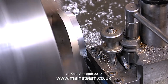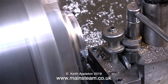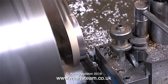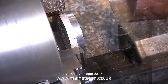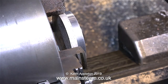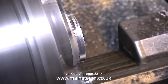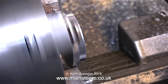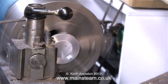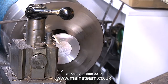This particular cutting tool does not cut very well on a left-hand cut, but it cuts very well on a right-hand cut, so I'm just pulling it back towards the right and I get a good finish. I test the cap against the water tank copper tubing — it's the same size so it's okay as a gauge. I'm using a file to remove the sharp edge, and please note: whenever you file in the lathe, make sure the file has a substantial handle. I then fit the component the other way around in the chuck, using a soft hammer just to seat it and make sure it's square with the jaws, and take a facing cut across the front of the work.